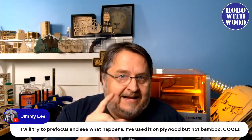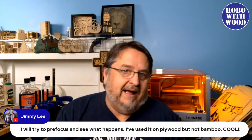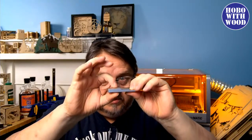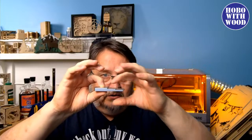Yeah. Now, but it's not just about the pre-focusing, Jimmy. Some of the people might be watching this on a replay, and they might miss some of it. With the way my brain jumps around, and you jump around my videos, you're going to miss something crucial, like what we're getting ready to explain. So I've made comments before that the laser beam coming out of your laser is hourglass shaped. The reason you have a focal gauge is because, and Rolly says the spot size on this laser is 0.35 by 0.22 when it's focused to a certain spot. And if you're going to be cutting, they want you to lower your focus. So you're lowering that optimal focal point into the material that gives you a better cutting power.